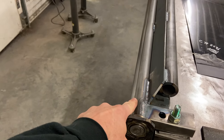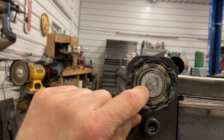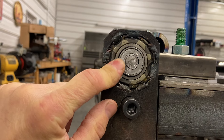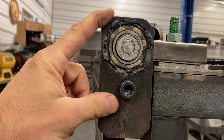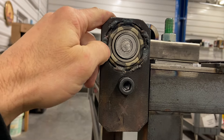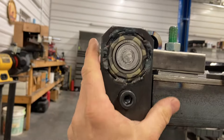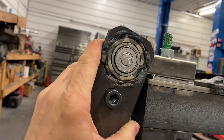The bar is actually a piece of chromoly tubing we use on the dragsters — inch-and-an-eighth, 058-wall, 4130 chromoly. Inside it is a piece of one-inch, 250-wall 4130 chromoly that a local airplane place had. You can order this stuff online, though things are getting stupid-priced right now. The bearings came from eBay — super cheap, easy to use, plenty strong. I posted pictures when I first built this and people freaked out because I TIG-welded to the bearing. I was real careful to keep the heat right on the race, did a couple dabs at a time. It's not going down the road — it's going 180 degrees at a time its whole life. It's perfectly fine, plenty strong.